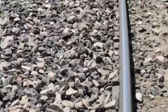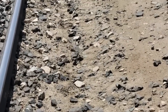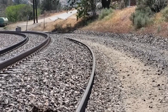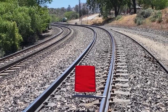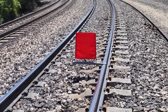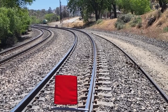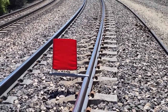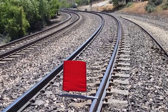This is the old rail, and you can look at it and see how worn it is. You can go back to my piece in How Things Work on the Railroad about why they use grinding trains and the different ways rail wears. When I did my piece on signs — you can go back to How Things Work on the Railroad and look at that video about what different signs mean. I didn't cover this because this isn't technically a sign; this is a temporary flag. The rail gang is working, their last piece of equipment is about a half mile up the tracks here, and this flag will tell anyone — a track inspector in a high railer, another work group, anyone — that there is track and time here, and this designates this as the end of a work zone.